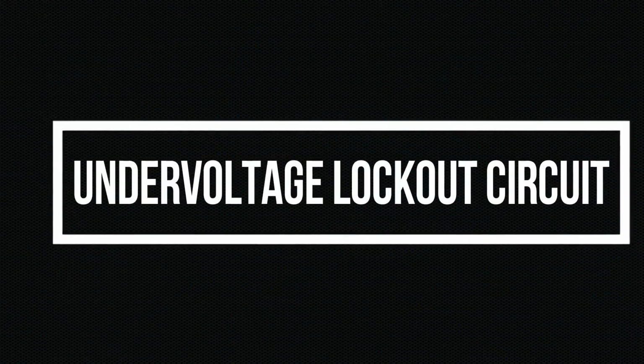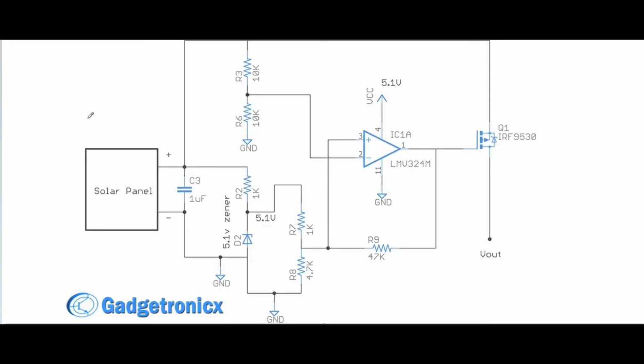This under voltage lockout circuit basically locks out rest of the blocks when voltage from solar panel is less. This is needed since voltage from solar panel can be unstable under cloudy conditions. Powering the receiver without using this might turn the circuit on and off, making it extremely unstable.